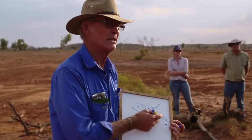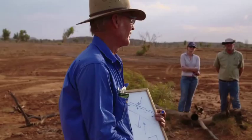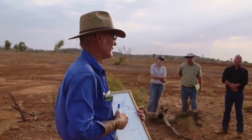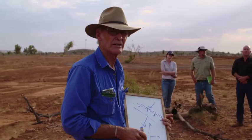It's a terrible thing for operators on three-point linkage machines because the control is behind you. If you're doing a couple hundred hectares, by the end of the day you just can't move your arm — you've got to redesign the lever position so you can operate it more comfortably. We put in half an hour up there with the grader just to simulate what the offset disc plough would do. As the water comes down the hill it hits that brickwork and filters through — the majority will be trapped and given the opportunity to penetrate and soak in, breaking the crust, especially in these soft, fragile soils.